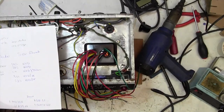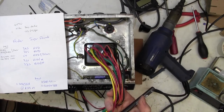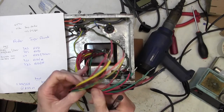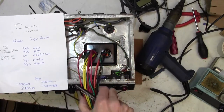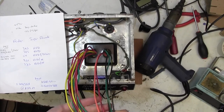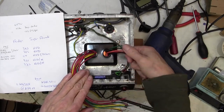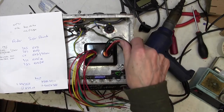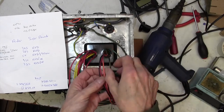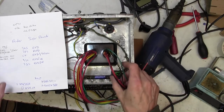My plan is to do this as live as possible — I think it's irritating when a video keeps jumping and everything's already been connected for you. What we're going to do is make sense of this chaos of wires. We have a crib sheet about what all the colors are that comes with the transformer. I like to start on the primary side — here are our primary windings, here are our secondary windings — and get the primary connected up. In particular, we'll start getting rid of leads we don't want: there are 230-volt taps, 220-volt taps, and some HT taps we don't need.